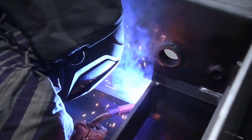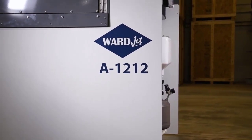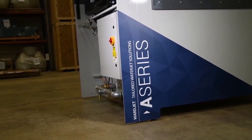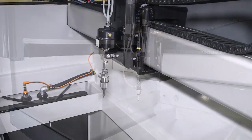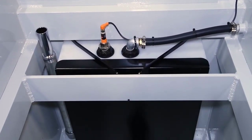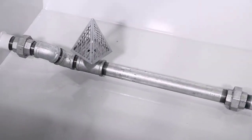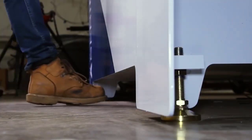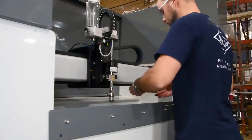The frame is reinforced with box-welded channels and tie beams that help to eliminate vibration during cutting. The machine's bulk feed hopper and electrical box are encompassed within the front and back walls, and the side walls were extended to deflect splashback. Two optional features reside completely within the boundaries of the tank, including the automated water level control system, as well as WardJet's abrasive removal system designed to continuously pull spent abrasive from the machine. An ergonomic toe kick was cut out of the tank walls, allowing the operator to load and unload the machine without bending over.